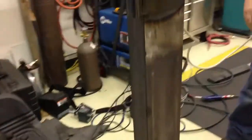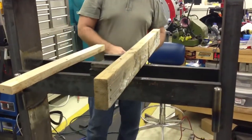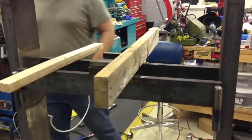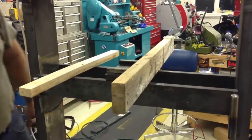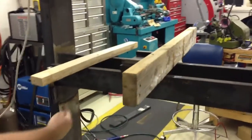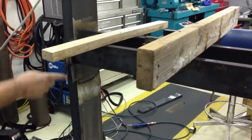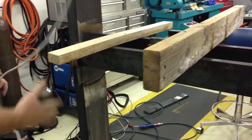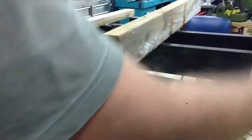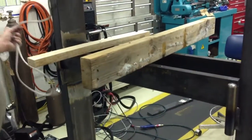We had a little trouble while we were welding it. We actually managed to spread the uprights by about three-eighths of an inch. By welding right here — putting welds on the bottom, welds on top, and then there's a nice heavy weld out here. In the meantime, the bars were pretty much all straight up and down, and after we welded them, they're out three-eighths of an inch.